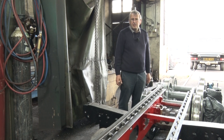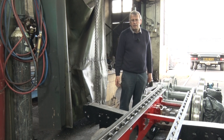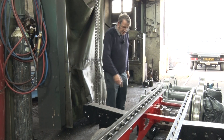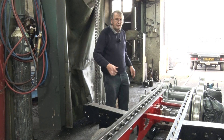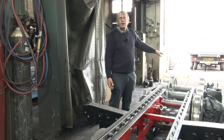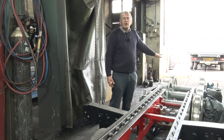There will be another step forward with the boiler on the frames, and that will allow a lot of other work to progress. There are outer frame pieces that run down the side that carry the tanks which can then go on. And there's another shorter set of frames that run backwards from the outer firebox, carrying the cab floor and the drag box at the back of the loco.